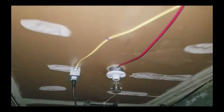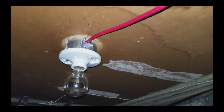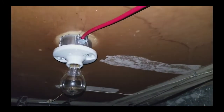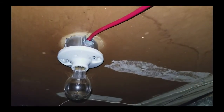For the power source connection, I added an extension box to the original lamp socket installation. The cord was fed into the box and secured with non-metallic cable clamps typically used for Romex installations. By connecting the power supply here, I maintained control of the lights using the house's wall switches. I can also fall back to the original light bulbs if something goes wrong with the LEDs or the power supply.